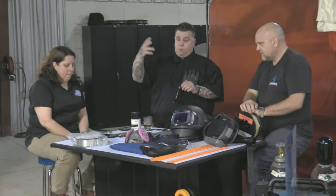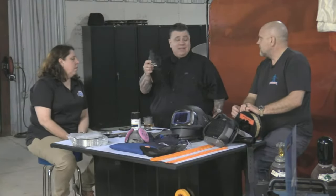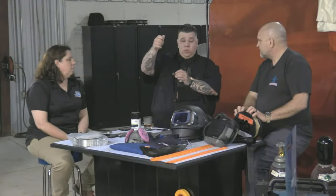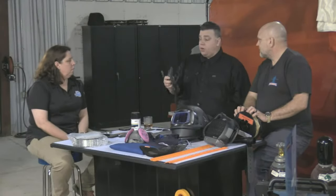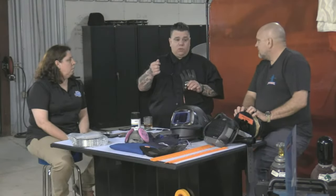Now, the guys out there that are certified through ISO with the European or the Tesla type vehicles, you're going to know I've got at least one glove on my guide hand, my front hand, that's close to the weld, that's heating up like crazy. I need a thicker glove or protection on my index finger and my thumb, because this gets super hot when you're trying to guide it. And you don't realize this. For guys who just started the Ford program, if you're making a long weld, a fillet weld or a butt joint weld, you realize your hand is burning.